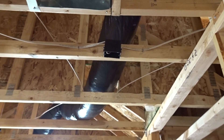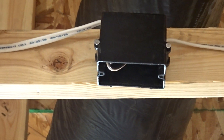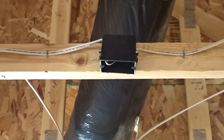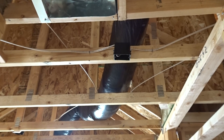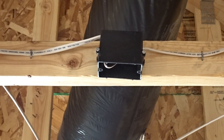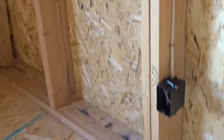You have to run three-wire - you want to run 14-3 from smoke detector to smoke detector, once you get them all installed. And from there, you need to power them up. When I say power them up, I mean you need to come off of one of the outlets in one of the bedrooms.